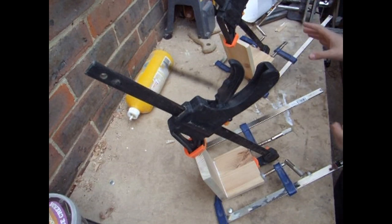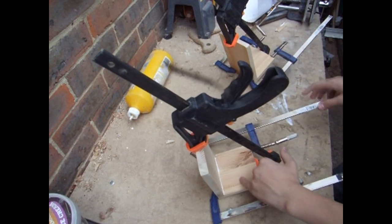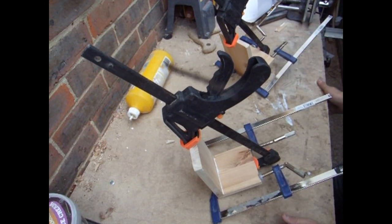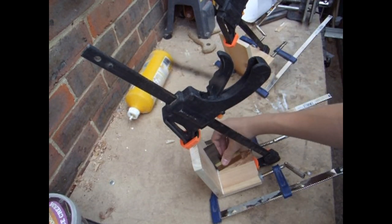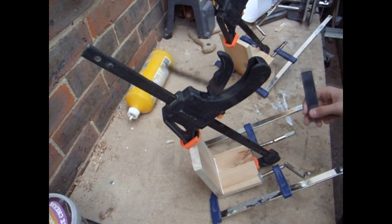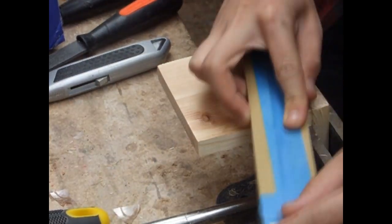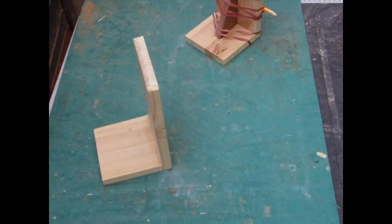Here they are all clamped up. I've used two quick clamps on each one to coax it into square and hold it at 90 degrees while it's drying. It's a quick little trick — hold your square up and just dial it in, although it's not critical for bookends to be perfectly square. It's nice to do things properly though. With the glue dried, I'm using some sandpaper to flush up the glue joints and clean up any squeeze-out.